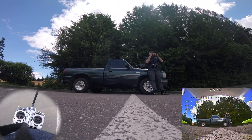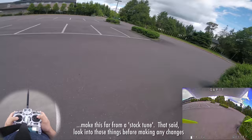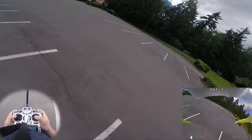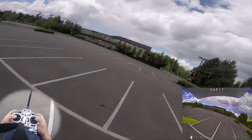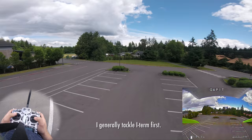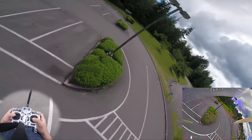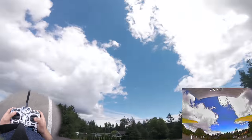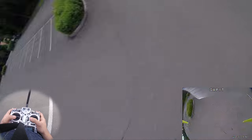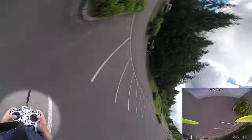I have yet to fly this FPV as well, so this could be fun for everybody. These aren't my rates — that feels close enough for now. So the first thing I kind of do is just little throttle bumps. It's actually not terrible. See how it's nodding a bit, though? Vertically? So that means I can crank I-term on pitch a little bit. This is a little mini H-frame, so it might need a little extra oomph on the pitch axis. We'll come in and we'll adjust I on pitch.